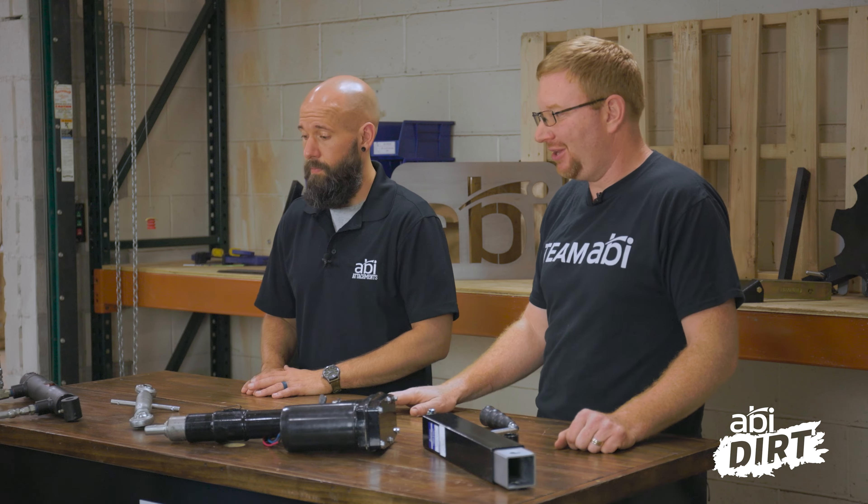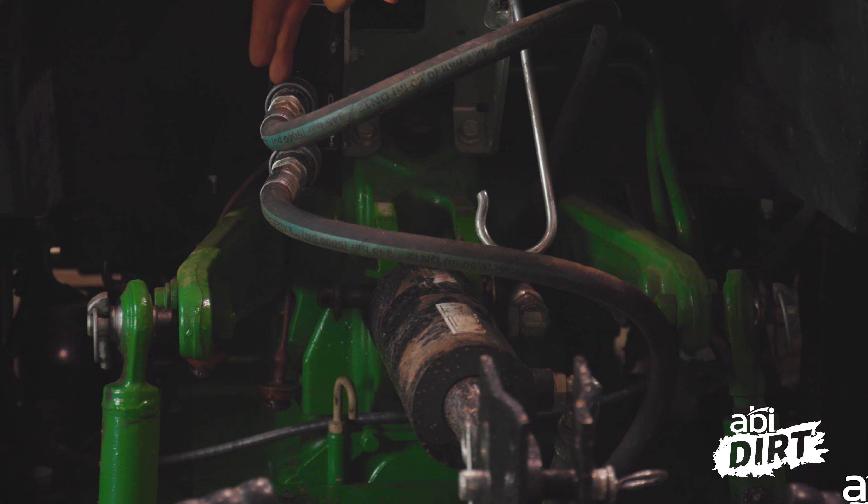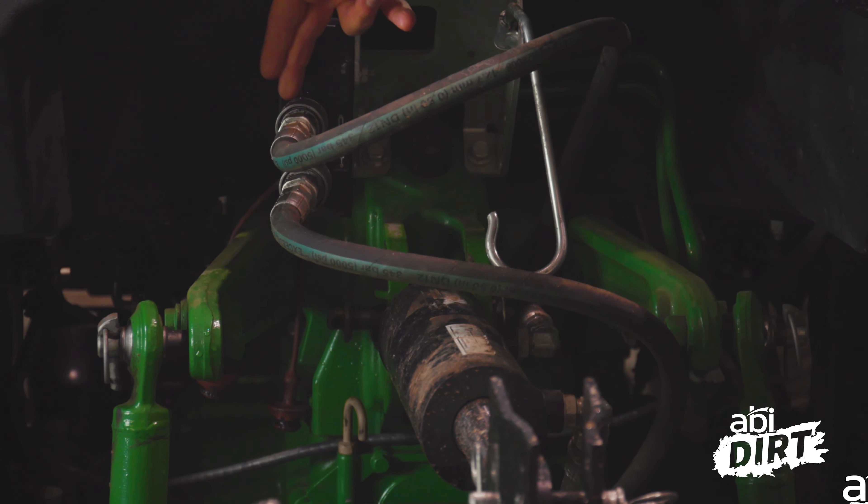The challenge really comes down to your tractor and how many different levers you have or are willing to pay for, because on the smaller tractors you're probably limited to one, maybe two. Our Drag Master really requires three sets of hydraulics — so you're talking sets of two hoses per set, meaning six hoses to hook up. There's running hoses and leakage potential — there are some challenges for sure.